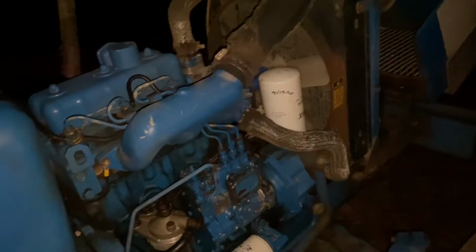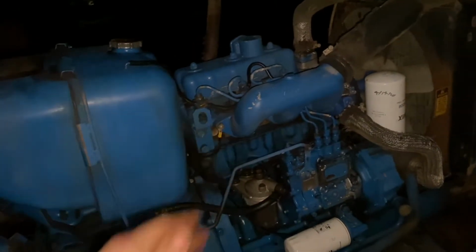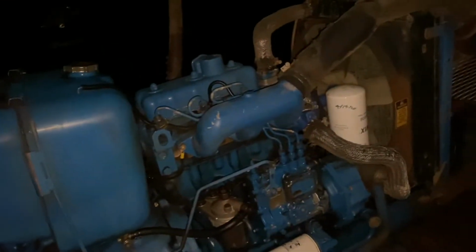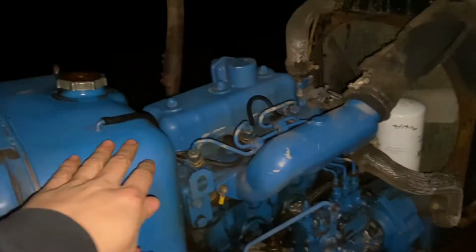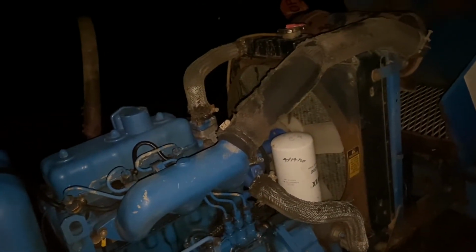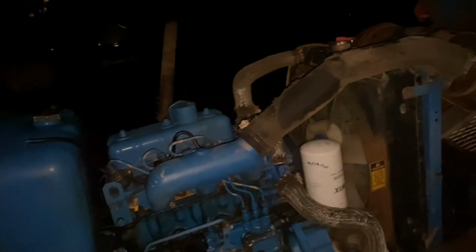I also did check the freeze protection. Those Walmart ones are a little iffy, but we had 3 balls floating for sure, so that's at least negative 10 degrees. The 4th one was kind of in between, so we'll call that negative 15, which is much colder than it ever gets down here in Georgia. So this is fixed. Now I can kind of trust in that a little more to not freeze and crack the block and rot out stuff again.